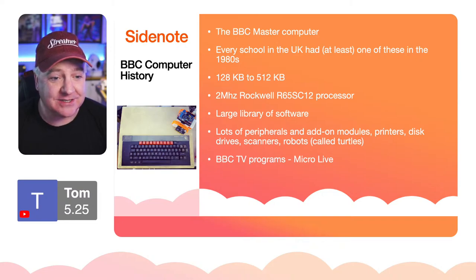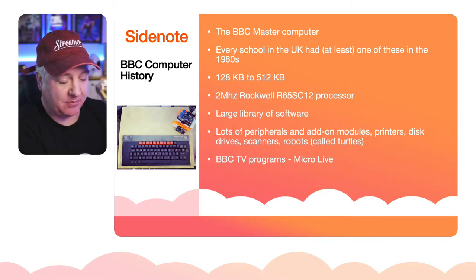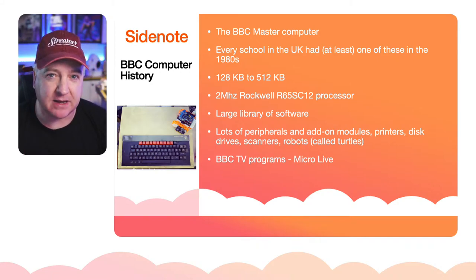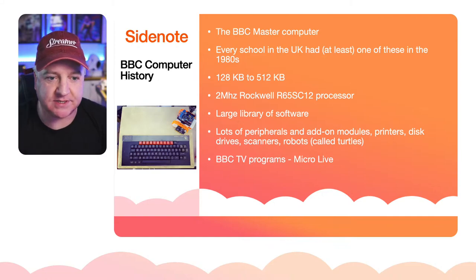So memory wise, these things are quite similar to what we have in the microbit. In the microbit, we've got a similar amount of memory, and we'll get onto specs in a minute. But the original BBC computer had 128K of RAM, and it had a 2 MHz Rockwell processor. So not ground shaking. If you think the Arduino is about 16 MHz, it can run slower, I think, but the crystal is at 16. So these are quite a bit slower.